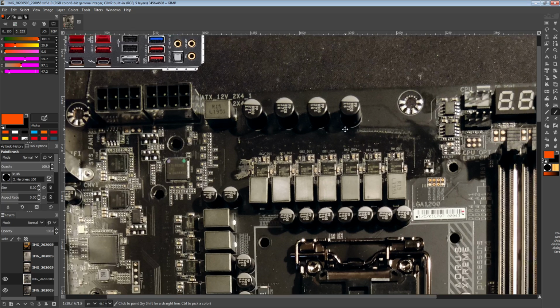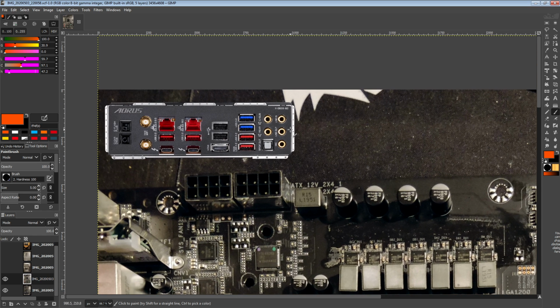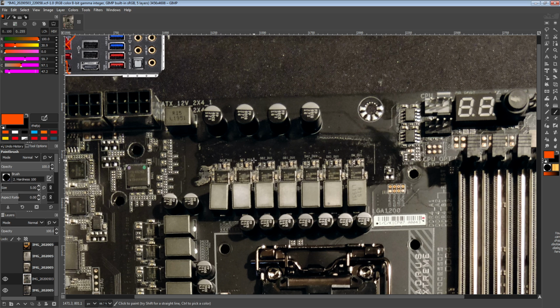But yeah, this is a really hard to justify motherboard in my opinion, in terms of just how expensive it is. I wish they made a stripped down version without the 10 gig or the Thunderbolt or the Wi-Fi. Also, the board comes with all of this metal heatsink work. Well, actually, it's not even heatsinks, just metal covers over all of the motherboard to make it more aesthetically pleasing to normies. Personally, I love the look of naked 90 amp smart power stages, but most people don't find those very appealing. But if they could ship this without the heatsinks and just the backplate, I'd be totally cool with that, especially if it would make the board significantly cheaper. Unfortunately, there'd probably be such a low number of people interested in buying a motherboard without any of the extra frills that they're never going to do that.